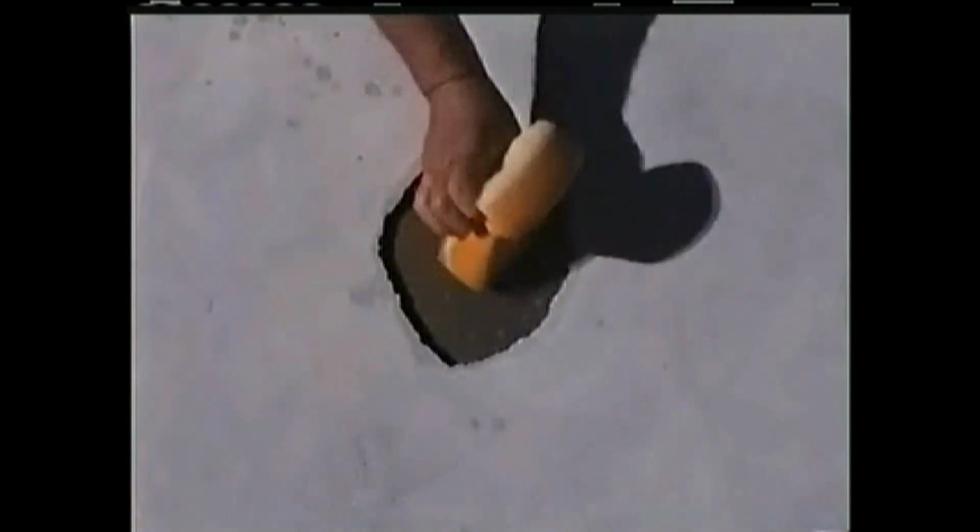Next, remove any loose quartz plaster. Clean the surface thoroughly with water and sponge. You can also lightly acid etch the area if need be. Remember to rinse the acid off thoroughly within 1 minute and dry with a sponge. Remove any excess water with the sponge.